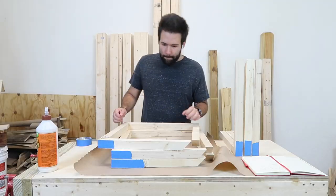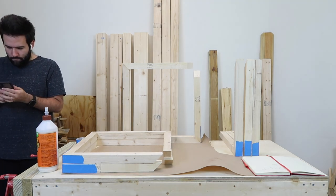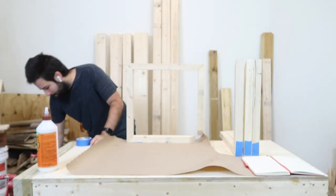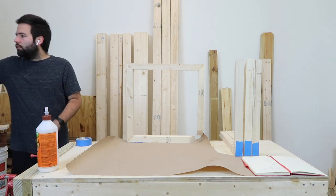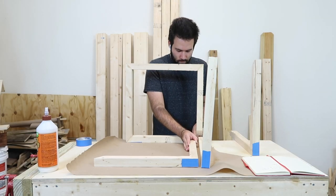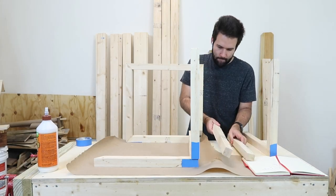After you let them dry, we're gonna start getting the build ready. Now you wanna dry assemble this and then you wanna glue it together. Now you will need only two pieces that should be about 1.5 inches tall, that you're gonna need them to actually have some spacing, because remember, all the sides are gonna be floating within themselves. So to glue this, make it easier, if you just grab 2 pieces of wood, it's gonna help each side stand and you're gonna be able to glue it without a problem.